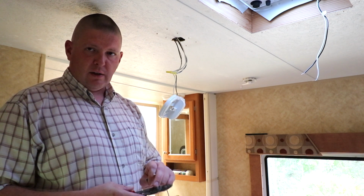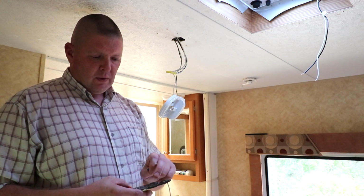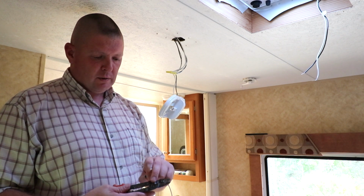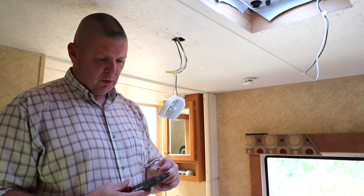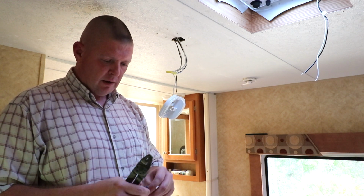The closer back to the hinge that you get, the more force that you can put, which is the yellow, which would be your bigger butt crimps. That's why you would need more leverage closer to that pivot point. The red one, of course, is your smallest butt crimp. That's why it's out further to the end.